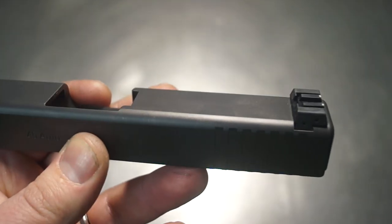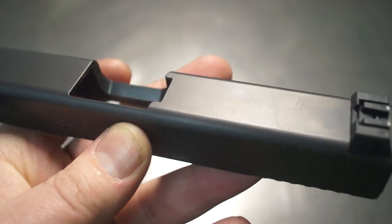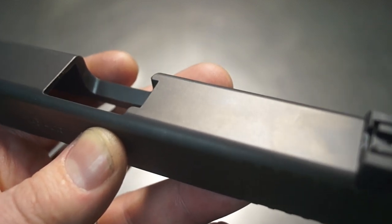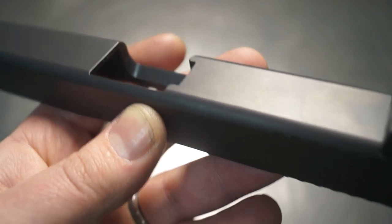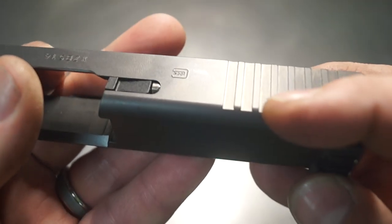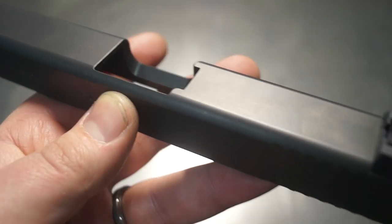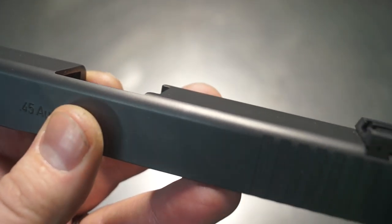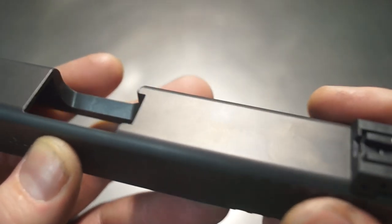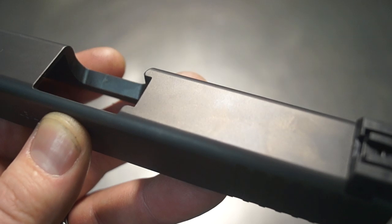We're only going to be hitting the plug when we drill a hole into the slide — we'll hit the cavity and then the plug. The plug could be made of titanium, stainless, or aluminum; we use aluminum. One advantage of aluminum is we'll be able to drill it a little bit farther than we typically would with a standard Glock, which means we'll get a little bit more threading on that side. Because of the extraction rod we can only drill so far on one side, but this side is pretty much open. We'll be able to use our screws all the way down to the full extent of the threads, giving a little more grab and structural support — a nice added bonus if the customer wants a screw that's a 16th inch longer.